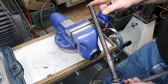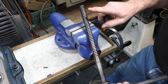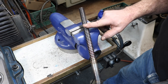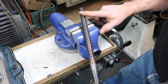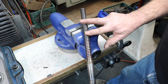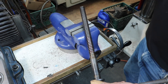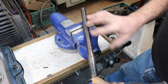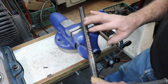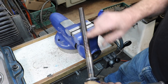Now this is the harder part of it. After looking at this screw under a microscope, it is an Acme thread, but it's not a standard Acme thread. It's four and a half TPI, not four, which is standard. This is three-quarter stock and the standard Acme thread usually used is six threads per inch. So this is not close to any standards — it's something special Wilton did, probably to make it a little more proprietary. So we're going to have to cut a four and a half thread on three-quarter stock.